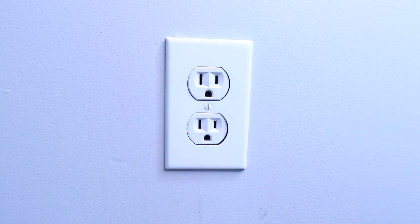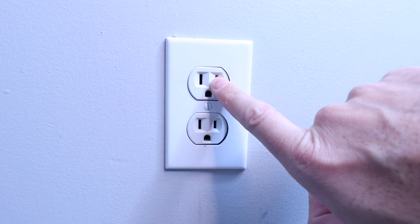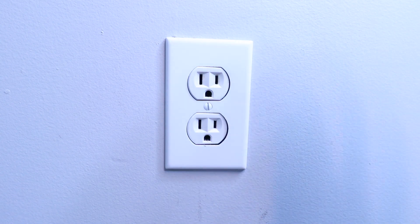In order to install this USB wall outlet, the first thing we need to do is go down to our circuit breaker and cut the power off so that we can safely work on this. We've done that, and now you want to check to make sure the power is off. One way to do that is plug something in and make sure that it can't turn on.